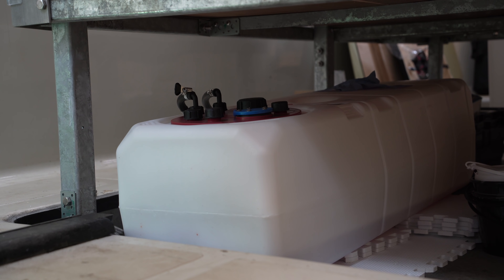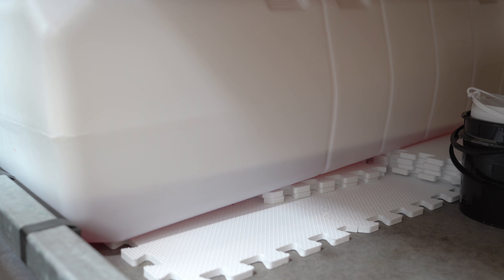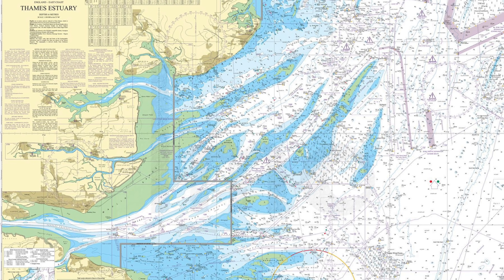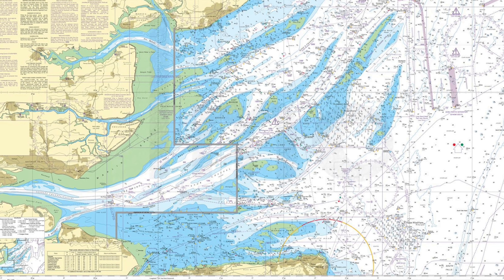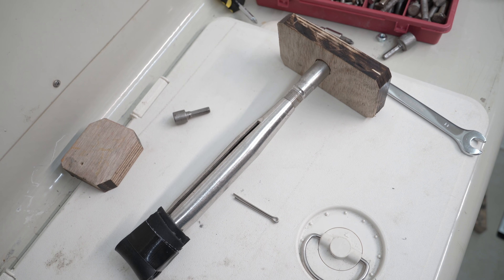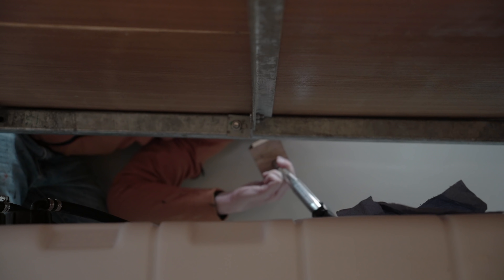The initial positioning is fairly straightforward — I've gone for a longitudinal orientation, as I think it will attract the least sloshing, though I have a solution for that which hasn't quite arrived in time for this episode. The sternward end rests against the racking box section, so I fitted a length of shock-absorbing rubber. Everything in this setup will be fitted temporarily until the end of the month's sea trials, then installed more permanently once I'm happy — duct tape for now. I've ramped the foam protection towards the bow, which is the end without the fuel supply hatch; whilst it'll slightly reduce capacity, this encourages fuel to collect towards the stern and limits any chance of a dry hose.